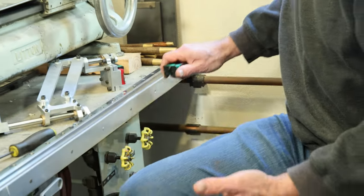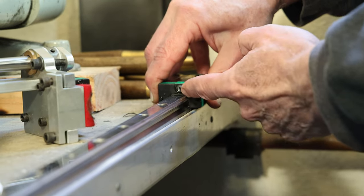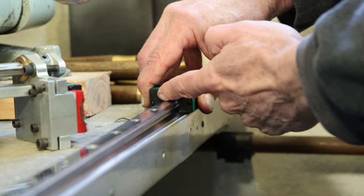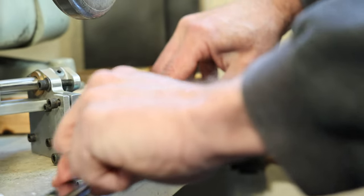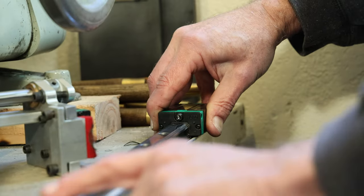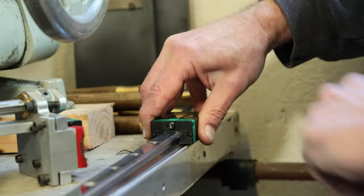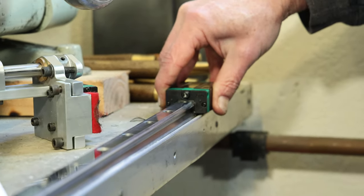The proper method for installing a bearing is to have its little plastic keeper in place, then line it up. There's a rubber seal that you have to kind of finesse the rail into. The seal is acting as a kind of wiper that wipes any debris off of the precision-machined guide rail.